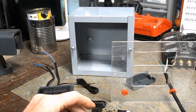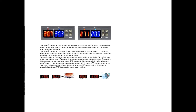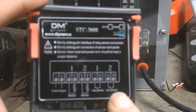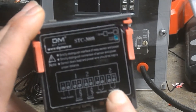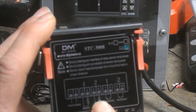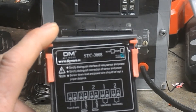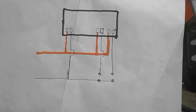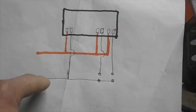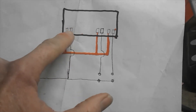These are where your outputs are. You need a source of power for these two output ports — just because the relay closes doesn't mean it's gonna work for you. You need a power source. What I did is I bought the 115-volt model, so here's my power cord running into my STC-3008, and I've got my two power leads coming in here.